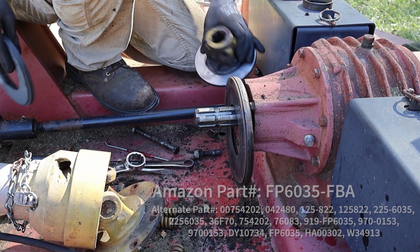Second steel, again, just one of the flat ones. This is our second clutch. And then this steel is the one that is shaped so that it goes over the back of the yoke. And then we've got a clutch in between that and this housing. And then our final clutch will go on the outside here, and it's what presses up against this mating surface here when it goes all back together.